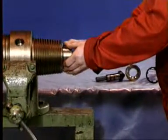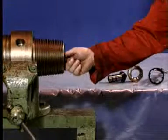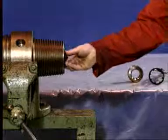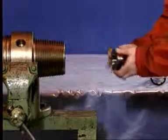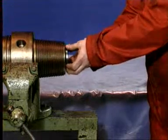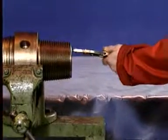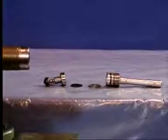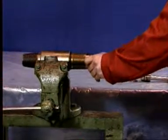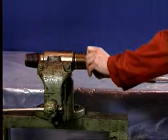On some hammers, the non-return valve assembly is placed into the upper end of the top adapter and retained with a circlip. On others, the complete unit is screwed into the lower end of the top adapter and then backed off, so that it seats up to the circlip.